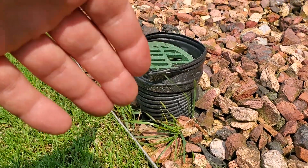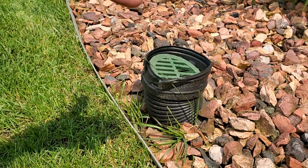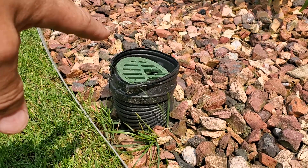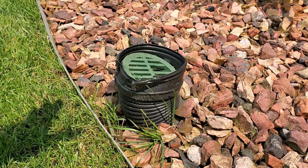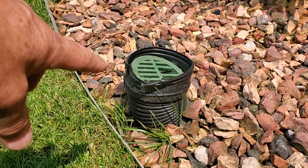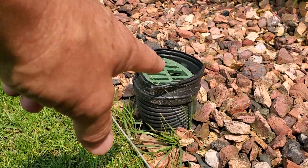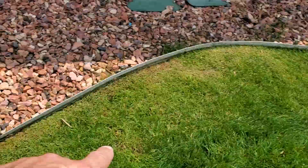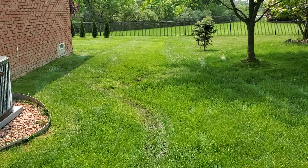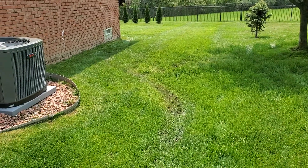This is a failed experiment. When you try to ask the water to come up and out, sure, this system will flow water — it's coming off the roof. But here's the problem: this thing's going to be full of water. Come winter, it's just going to freeze up. This needed to go out to where the grade broke and then to daylight. Or I like taking it right to the storm sewer and doing a core and doing it the right way.